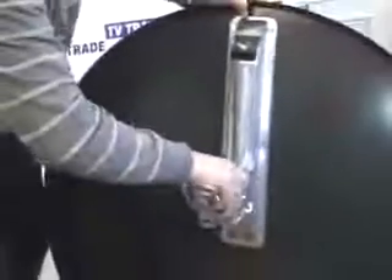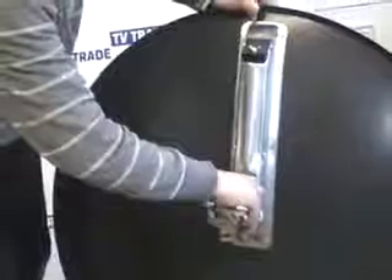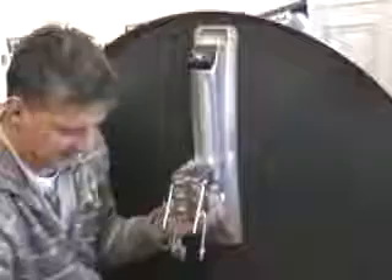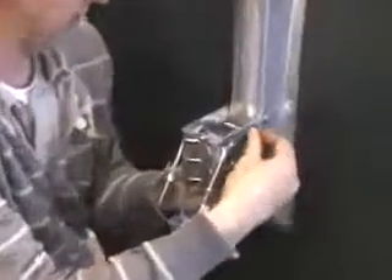Next we take the angle bracket and slot it into position, clipping it on one side and the other. If you're unhappy with the position, it can come off quite easily. We then use bolts to lock in the elevation — using the top set of holes and the bottom set of holes. On this side of the dish you can see the elevation settings, ranging from roughly 25 degrees all the way up to 90 degrees, and you pick your desired elevation.